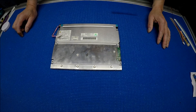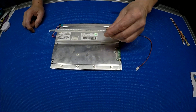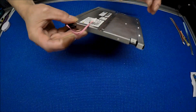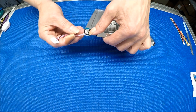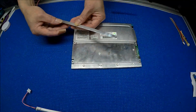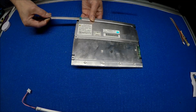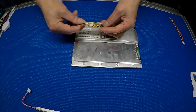To upgrade the LED kit, it's super simple for this particular screen. This one is actually custom built for an 8.4 inch NEC screen. Basically, you just push down this plastic latch, slide down, take it out, and then you insert the LED kit. Just push it right back the same way. Done deal. Then you connect to this side, either side.